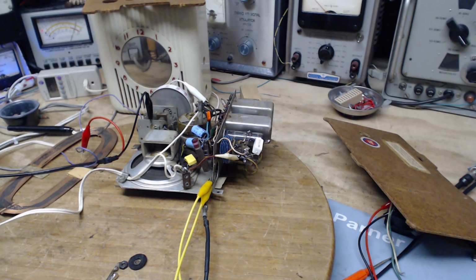And you know what? It doesn't seem to. I thought I read somewhere, but then I could be thinking of some other radio. Set the signal generator and receiver to 1600 kilocycles and adjust the oscillator trimmer C4A for maximum output. I want that done at 1600, but the radio receives 1700, so that's not the end of the run. I could do it right at 1700, but there's a reason why they're suggesting 1600. It's probably a better place to do it.